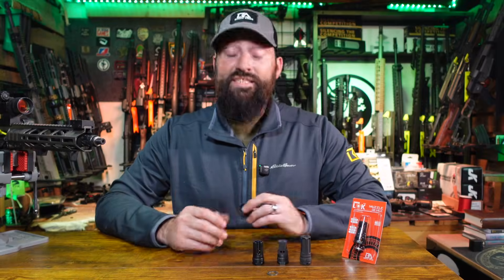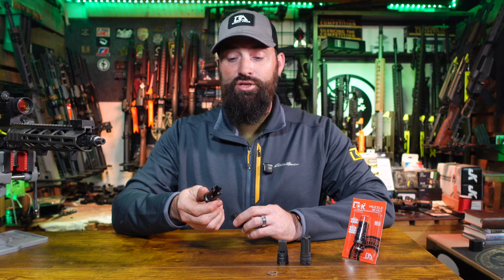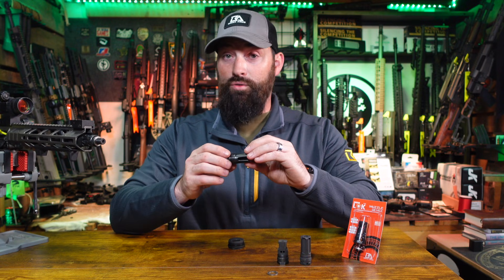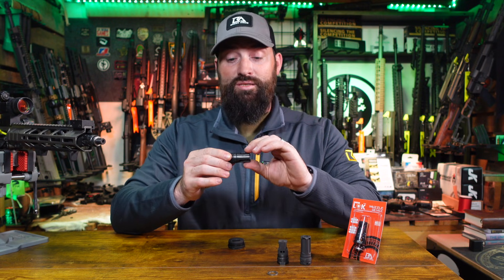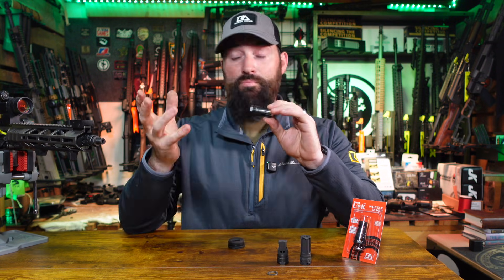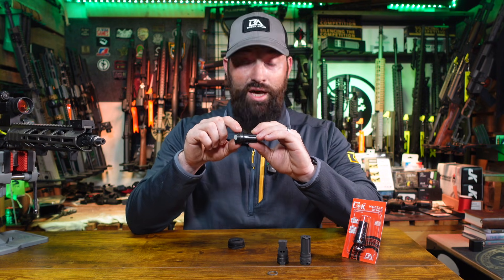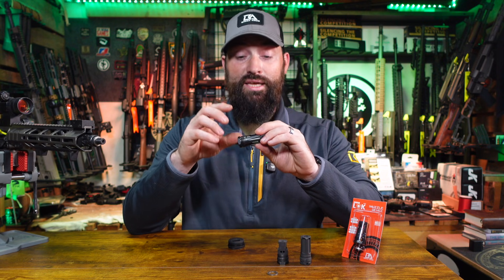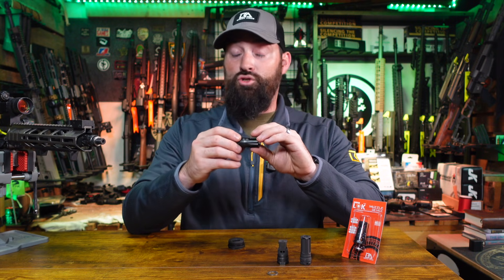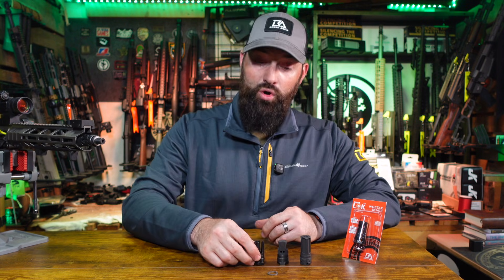So Plan B — what is it? It's a mounting system. I believe it was made by Q back in the day. They're the ones that engineered and designed it. It's pretty much open source now, where anybody can really make these mounts and give their own flair on it. The design is built around a taper mount, behind which there are threads. The beautiful thing about this system is the tapers are in front of those threads, which means the threads should never get carbon locked. This should never really get impossible to remove your suppressor from your muzzle device. It's very simplistic — no ratcheting or pieces to wear out. It's a simple taper and thread design, and we have our own spin on it.